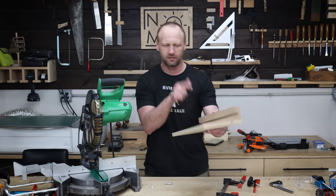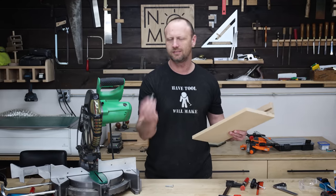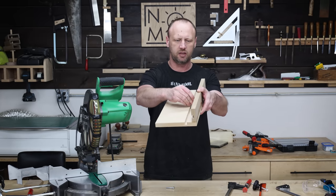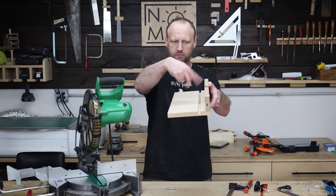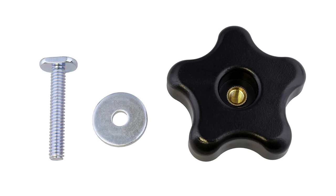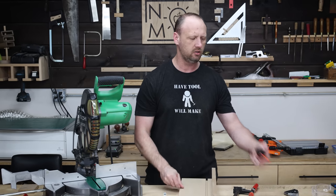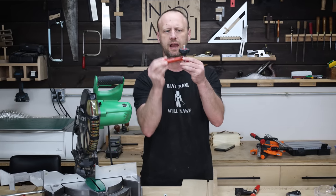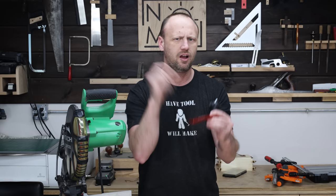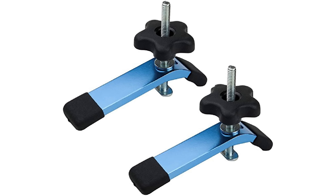The glue is dry, and the good thing about the dovetails is that different bolts will fit in there. So if you have different types of clamps, it all works — this is a quarter-inch bolt, just a regular quarter-inch bolt that fits in there really good. And you can't spin it around, which is perfect for having some sort of knob on it. You can also get bolts that are rectangle-shaped, which are specifically made for something like this. I'm going to use one of these lever clamps, which are pretty handy to have. I'll see if I can find an affordable pair and drop a link in the description below.